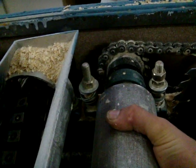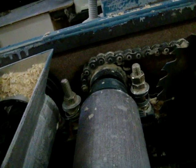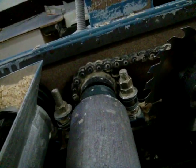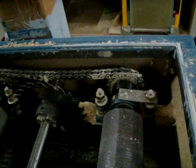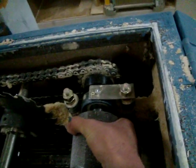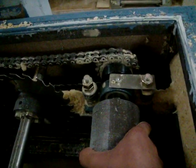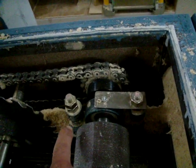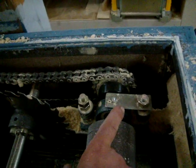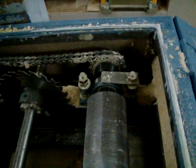These are just two hardened bolts with springs. I tried all kinds of different setups starting with valve springs and ended up using these really small springs, which seem to work the best. This plate here is really springy, so it allows the bearing to go up and down. The chain was pulling on the whole roller and it used to get jammed on these bolts, so using that plate keeps it from moving side to side — only up and down. It took me a while to figure out, but now it works pretty good.